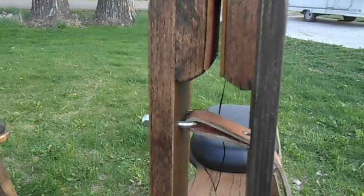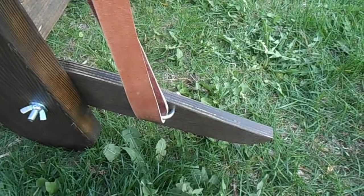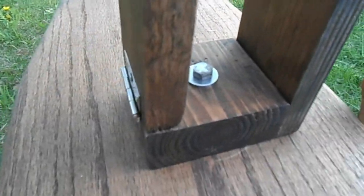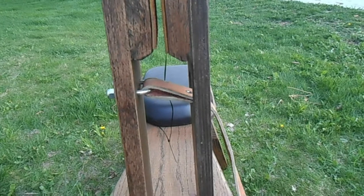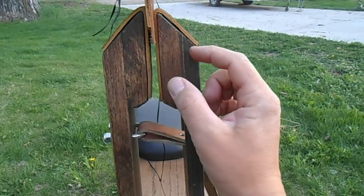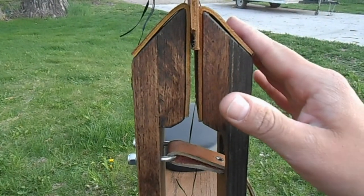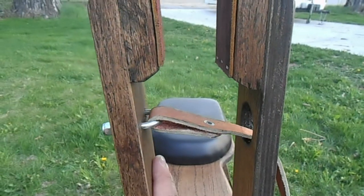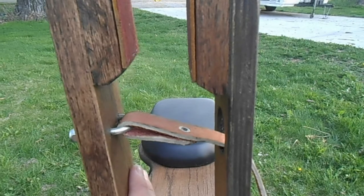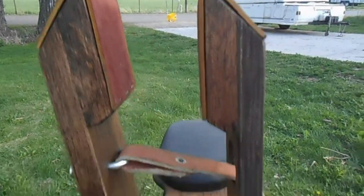I'll give you a closer look at the mechanism. The jaws have just a U-bolt that goes through holding the leather strap in place, which runs down to another U-bolt on the pedal. If you look in here you can see the bolt that goes all the way through — basically just a hinge on one side. These jaws are made of three-quarter inch material with another three-quarter inch piece with a 45-degree angle cut all the way up to the top, and I've covered that with some extra leather. When the hinge is open it drops your material.